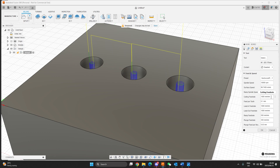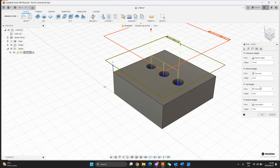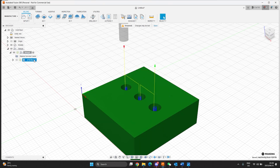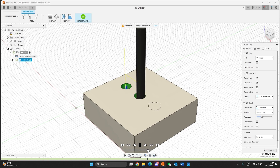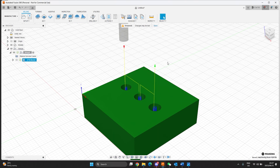Just make sure the right tool is selected — that's tool number one. I will reduce the feed rate to 500. We've got the three faces. The top height is the hole top, so the top of the hole is offset from that. The bottom height is the hole bottom — if you want it to cut through, you can set minus 0.5 and it'll cut through the bottom. So that's our first operation. Let's check the simulation — it'll bore down like this, and this will be very fast because it's close, the next a bit slower, and this one even more slow. That's what we want — the holes are through.